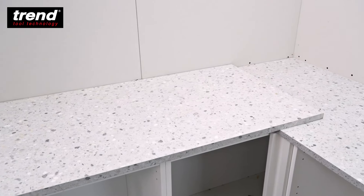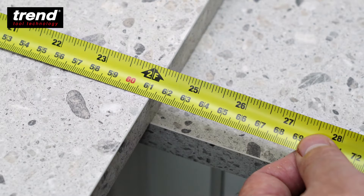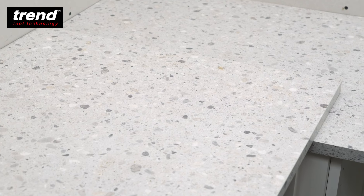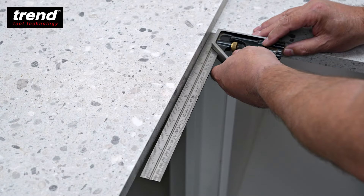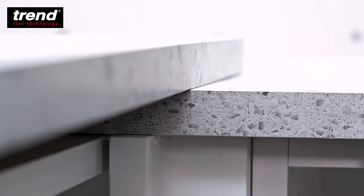With the scribes made, you can see that the 620 mm worktop is now 614 mm and 606 mm at the joint intersection. The joint is easily and accurately marked without the need for any measurements. Using a square, mark the intersection of the joint onto the worktop ready for the female cut.